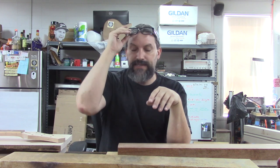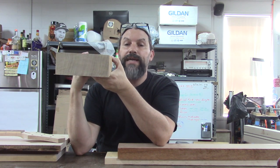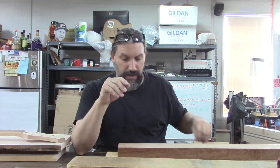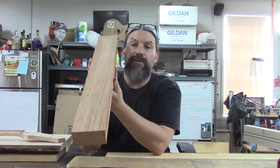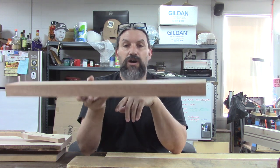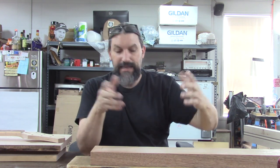One of the reasons we chose to go with a seven-degree headstock on our necks is that the neck blanks can be eight-quarter and we don't have to get twelve-quarter or ten-quarter to make up for that headstock angle. So this will one day become a really nice one-piece vertically oriented neck blank from my secret stash of white limba — very few of those left. Here's a piece of vertical grain mahogany with the neck blank already drawn on it; it's going to eventually be a Challenger neck blank.